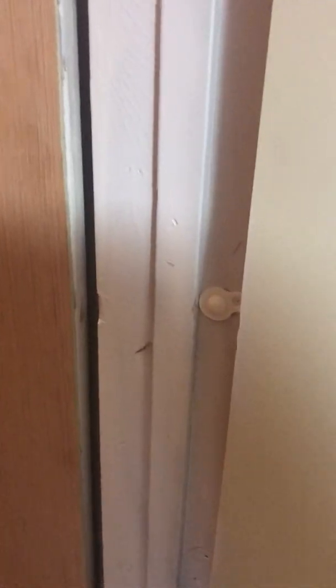What I did is I put inside the door here a hidden door sensor, and I'm using that as an interlock. I've got one on the first and second floor as well as magnetic door holders. When the elevator is on the ground floor it's de-energized so you can open the door. As soon as the elevator lifts off its limit switches on the bottom, it's going to pull in relays. I've got IO links here — one listed for up and down — and I can use those to track status and control my magnetic door locks.